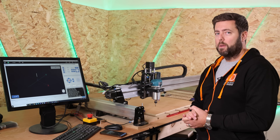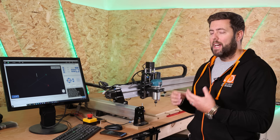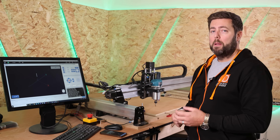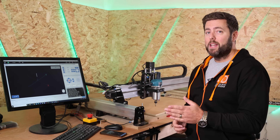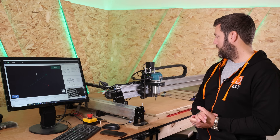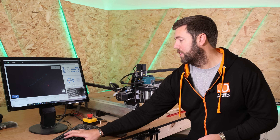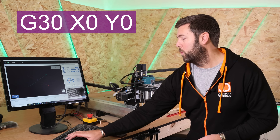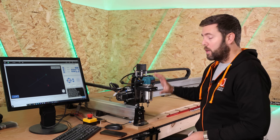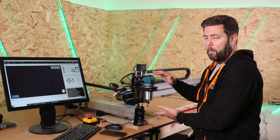There are some variations you can do with this. You could tell it to move only on the X and Y axis and not the Z axis. Whatever axis you want it to move on, you simply put at the end: G30 space X0 or Y0. So just to show that, I'll home it back to start. Then in the console I'm going to type G30 space X0 space Y0. What we're telling it to do is move back to that saved position, but don't adjust the Z axis — only do it for X and Y. You should see this time that the machine doesn't move up and down at all.